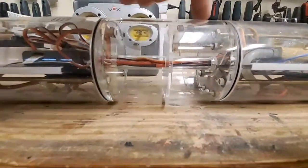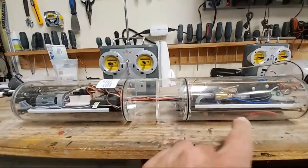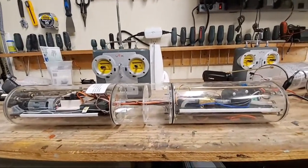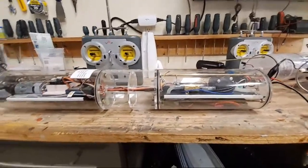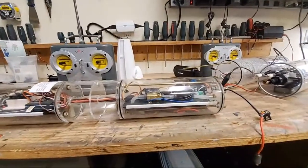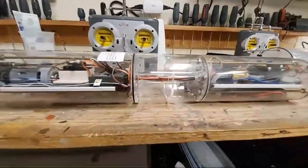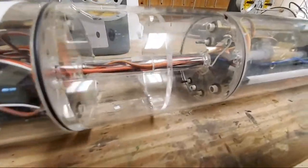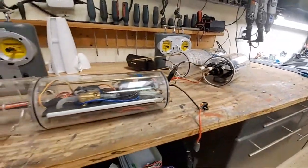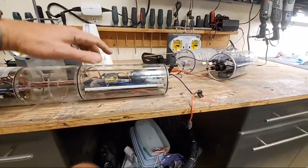That probe is basically telling you that the tank is full. So the pump kicks in, the valve opens, the ballast tank fills, then the pump shuts off and the solenoid valve closes — which stops water from flowing back. To surface, you do the exact opposite: the valve opens, you kick the pump on, and a combination of water pressure and the pump pushes the water back out. What you'll find is that it's often impossible to get all the water out, because the inlet is about two millimeters higher than the bottom of the tank — which causes a little condensation issue.